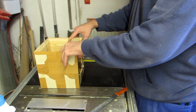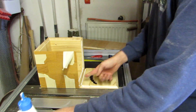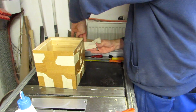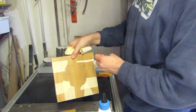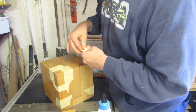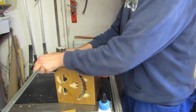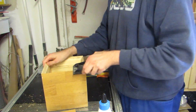After I was satisfied with the result, I put the face back in place using the tape that was already there, added glue, and used the tape I had used as a clamp before to hold the face in place while the glue sets. After removing all the tape once the thing has dried, I'm using a block plane to take off the edge on all the edges, since the miters that didn't align perfectly aren't that comfortable to handle. I've been told I recently disappointed some fans because I mentioned a block plane and didn't use it — so here we go.